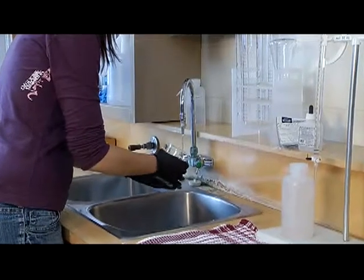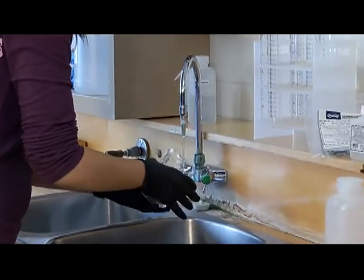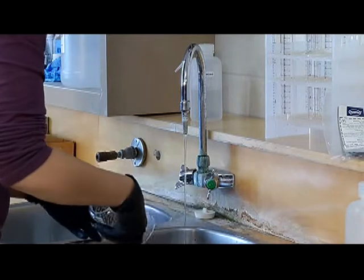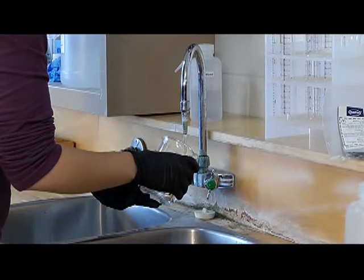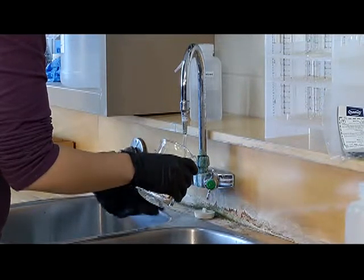After the water has flushed for the prescribed time, rinse the container you'll use 3 times to remove any contamination from previous samples. It's always recommended practice to slow the water flow for sample collection to reduce air bubbles in the sample. In some cases, such as turbidity testing, it's required for a valid representative sample.